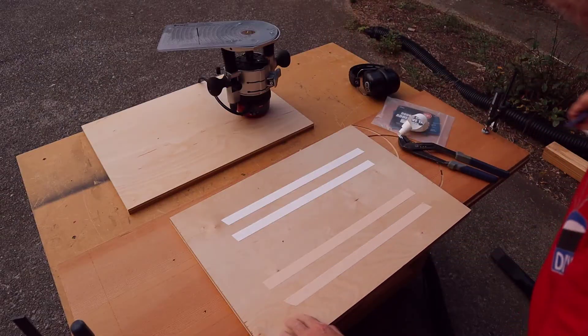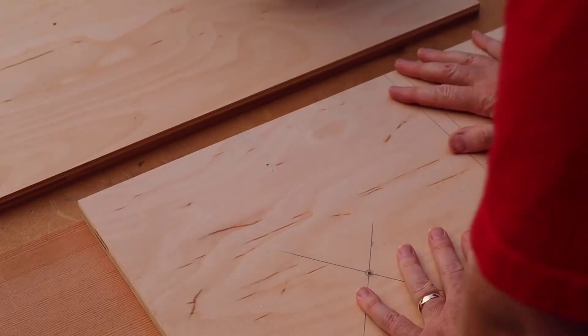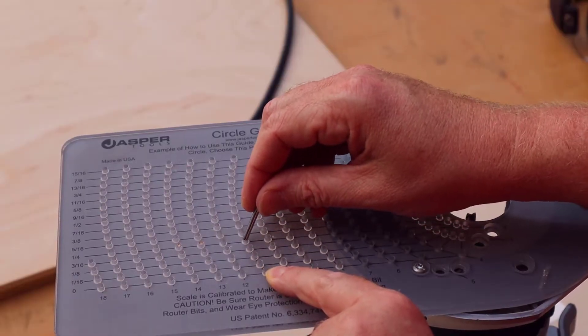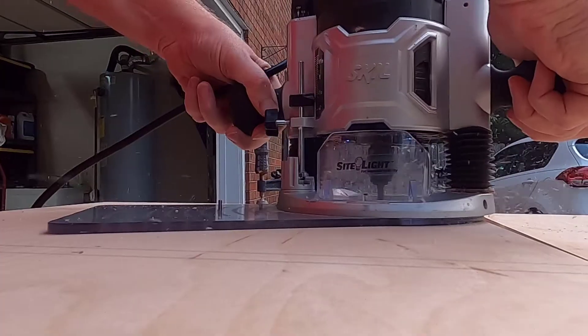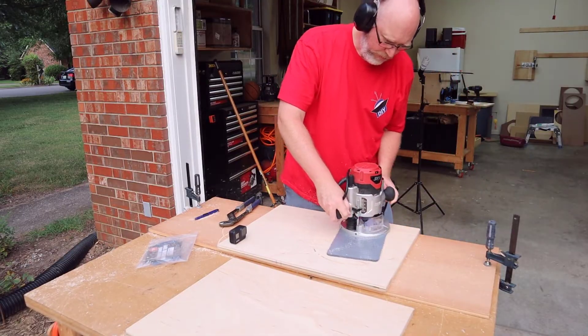The really tricky part about this build is the speaker cutouts. The specifications are all in metric, so you've got to convert them over to their freedom units — we use freedom units here on this channel. The cutout is 288 millimeters, which is just about 11 and 5 sixteenths of an inch. I went with 11 and 5 sixteenths of an inch for the cutout. The overall outside diameter when converted was 12 and a quarter inches, but that was actually a little bit snug when I did my test cut. Since I'm going to do a recessed baffle, I need to know that number.